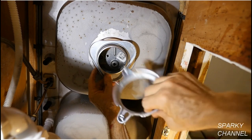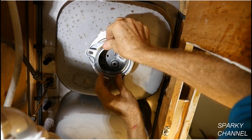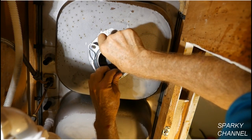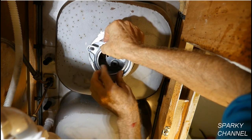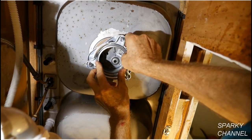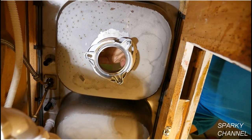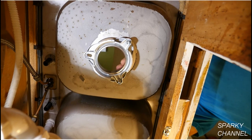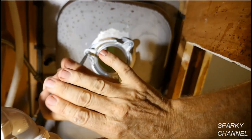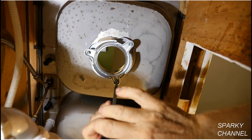With the screws of the mounting ring in the loosened position, insert the mounting ring and then install the snap ring on the groove of the throat piece. It really helps to have a helper pushing down on the throat piece from the top. Keep working at it until you hear the snap ring snap into place. After making sure your flange is centered, tighten each of the three set screws in turn like you would tighten the lug nuts on a wheel — tighten one, then the next one, then the next one, and keep going round and round until they are all very tight.